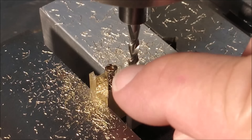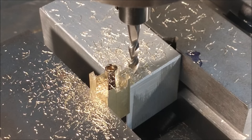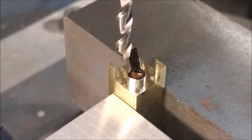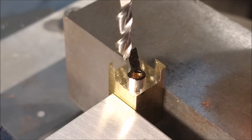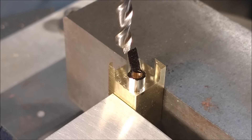Observing where the cutter was — the cutter was up beyond center — so that had to be an X-axis move. I jumped off the part halfway through in the X-axis. I'm going to reset and conventional cut the opposite side. Cutter is reset to the tangent spot on this side; I'm going to conventionally cut, go about two-thirds of the way around, and walk off it in the direction I think is necessary — probably pulling the table off the cut this time as opposed to pushing it off.